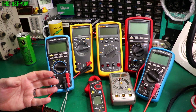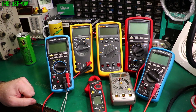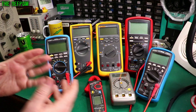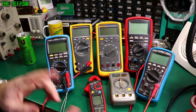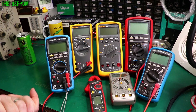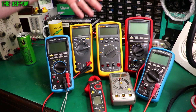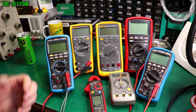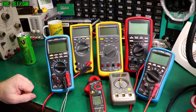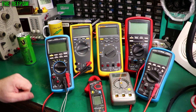In my beginner video series — I've actually done an electronics for beginners series, and this is the electronics tools for beginners. In the electronics for beginners series I've actually done a multimeter video and gone into a lot more depth about that. So maybe you want to look at that one as well. All I'm trying to say is basically you don't need a Fluke — unless you're doing high voltage stuff, in which case you do need a Fluke or a Brymen or some kind of equivalent, which is designed to handle those safety ratings and be safe for you to use at high voltages if something goes wrong.